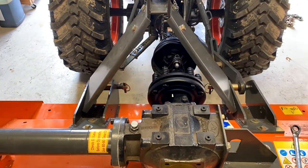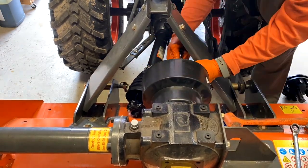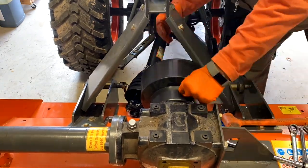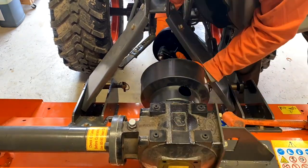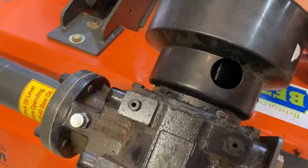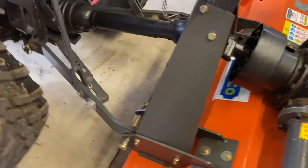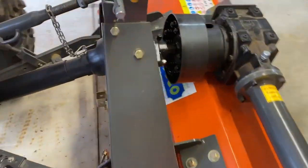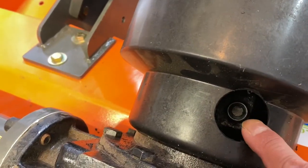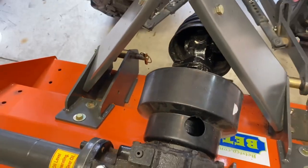Now that that's done, we're going to put the safety cover on, so we've got to take everything back off. This cover stays stationary and then it lets the clutch spin inside of it so you can't get tangled up in it. I put the safety cover on, and I had to bank a hole so that I could put that one pin in there to lock that slip clutch in. Put it into neutral — I'll show you what I'm talking about. Now you can see the pin to lock that clutch in, and besides that, it's all covered up now.